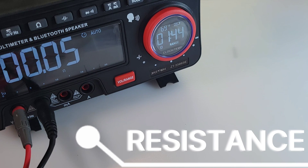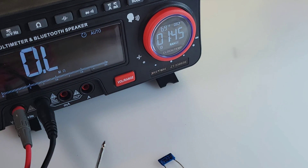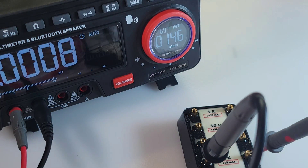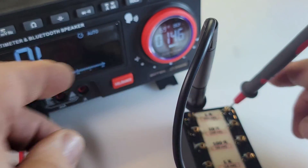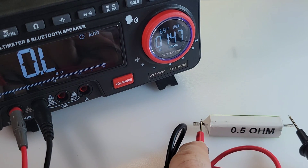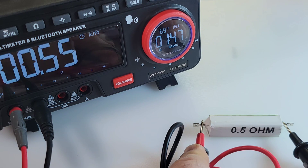Going into resistance now — test leads have about 0.05 ohms of resistance. A nice feature of this meter is the 200 megaohm range in resistance — 200 megaohm, that is a lot. Testing 1K — beauty. Let's try 10 ohm — not quite as good. Finally, one ohm — well, that's not too shabby. How about the dreaded 0.5 ohm resistor? Look at that: 0.5-ish. Excellent.